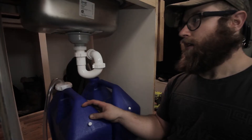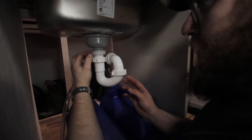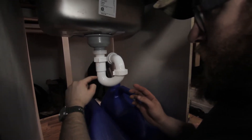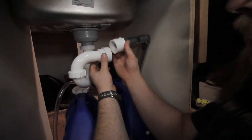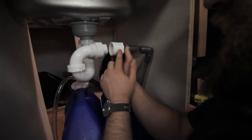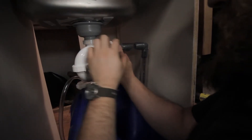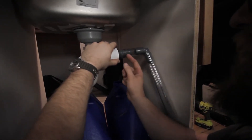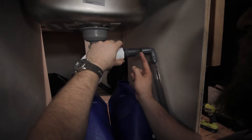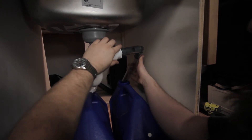The sink is on and now it's time to install a butterfly. Here's a brief walkthrough of our plumbing solution. This clasp will connect this pipe to the P-trap. The P-trap will wrap around and adapt here. We have yet to PVC cement this, but this will fit into that a bit more snug. This will adapt this diameter to this diameter. We have this vinyl hose that's going to go out from that adaption and then go down 90 degrees. This is our exit for the gray water, which will be sliding into place here.